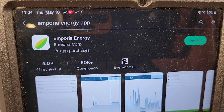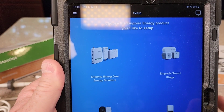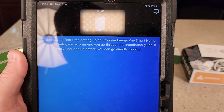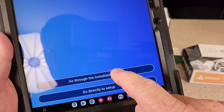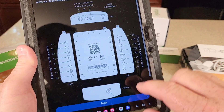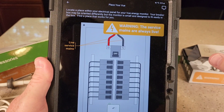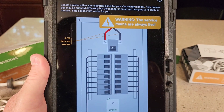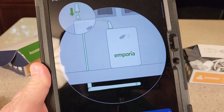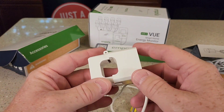Here's what the app looks like — you do have to download it. It doesn't really come with an installation manual, so we're going to download the app. You have to create a username and a password, verify it, and enter a code from your email. The app walks you through a bunch of safety precautions because you're going to be working on a live panel — they want you to turn the main breaker off. But up above the main, everything will still be energized, so you can call the power company. They are required to come remove your meter and remove power if you would like. The antenna is to be run outside the circuit breaker panel — this part goes inside the panel and you run the antenna outside. They want you to put the bigger sensors across the mains, and I'd definitely recommend calling the power company to have them remove the meter so the panel is completely non-energized.